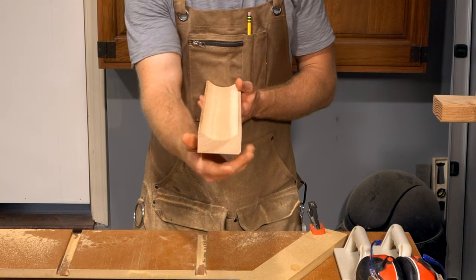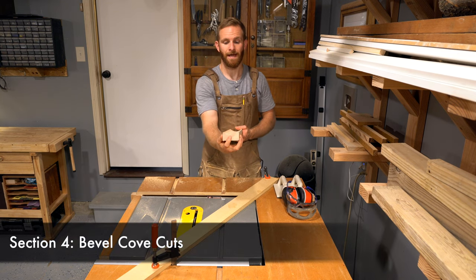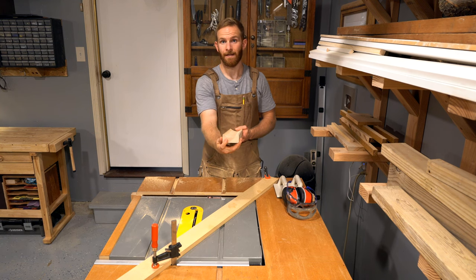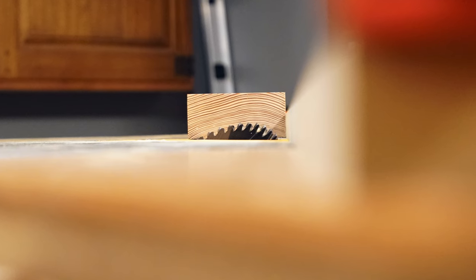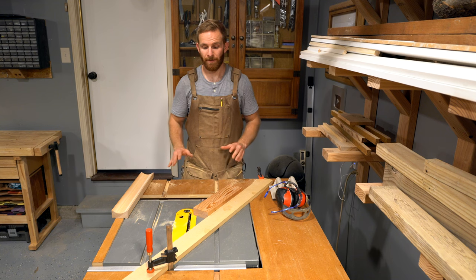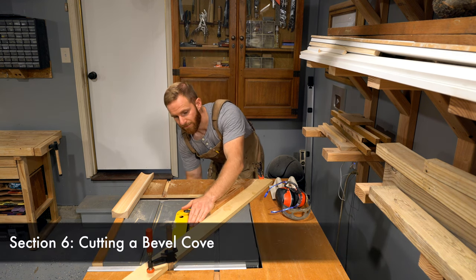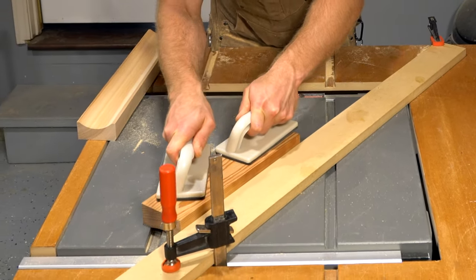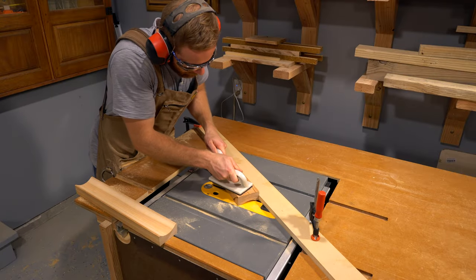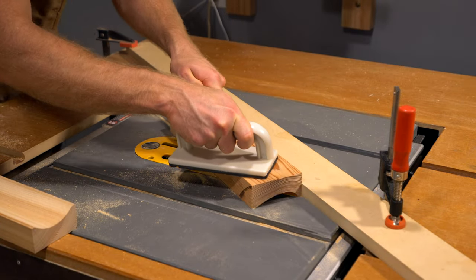I have the bevel at 45 degrees, which will be the most drastic apex, and you'll definitely see the difference between this cove and the last one we just cut. Lower the blade all the way down, then raise it up just so the teeth are showing, and make your first pass. Every pass after that, raise the blade up one full turn until you get the desired cove cut. Make sure that the bevel is beveling towards the piece of wood — that's going to cut much better and much safer.